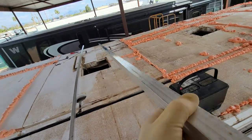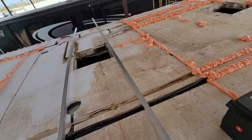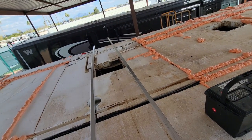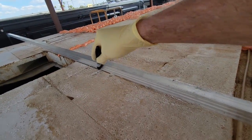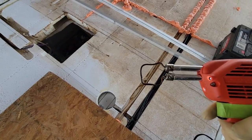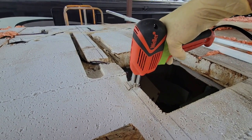I'll use this one-by-one pretty thick-walled square tube aluminum. I'll cut out the foam, then I'll bend it with an arch, then have it recess-mounted to help carry the load, and glue it into place. I've made a few of these before using a tubing bender — it'll round the edges a little bit but it turns out pretty well. I've got a marker right there to lay out where it's going to go and where I'll be cutting out. I made a profile of my tubing on my soldering gun right there, and I'll just cut this stuff out.